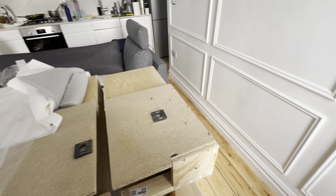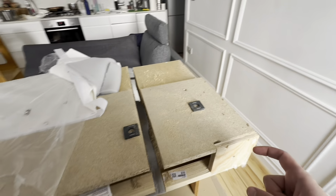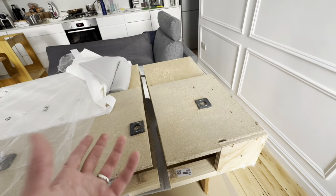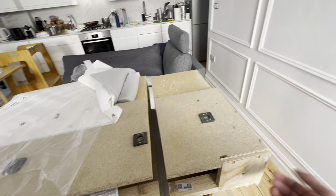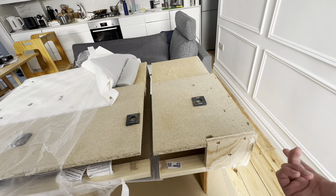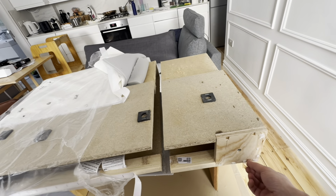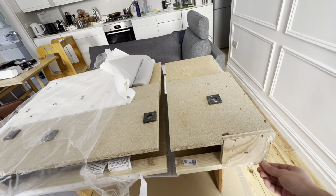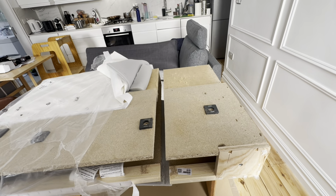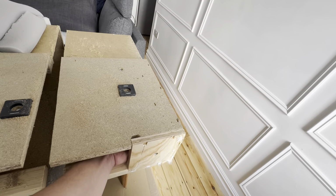They've obviously stapled all this stuff together. I would personally, if you do have it, use a little 3mm wood drill bit and some 30mm screws. They won't go under a lot of pressure because it'll just be getting pushed into the floor when people sit in it, so it doesn't need to be fixed on by anything crazy. They've obviously used staples for that reason, but you either need a pretty decent, powerful stapler instead of the little hand pump ones. They may do it, but I have a feeling they won't. And many more people have access to just a drill or a screwdriver, so that's the simpler way, and that's all it's attached by.